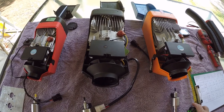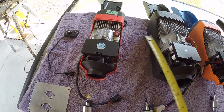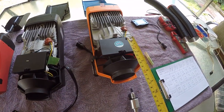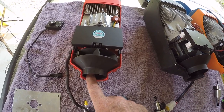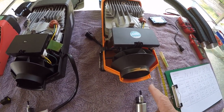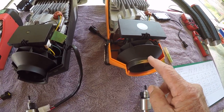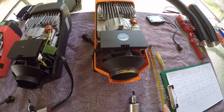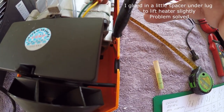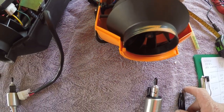One of the first things I check is whether the fan rubs, because occasionally you get them with a fan rub. I've got two different heaters bought at different times from the same manufacturer — a 2 kilowatt and the so-called 8 kilowatt — and I can feel slight rubbing on the fan on both. I let one run and it actually melted the casing but not the fan itself. It's not a huge deal — when they did the molding for the case, this part was not quite right, perhaps only half a millimeter out — the tolerances are so fine.